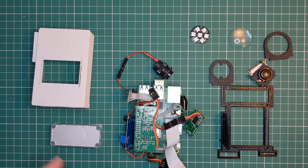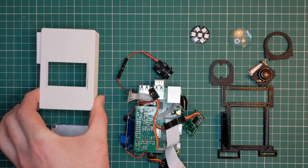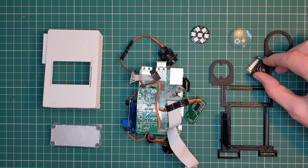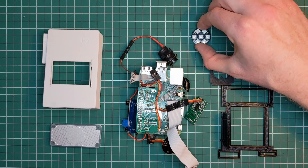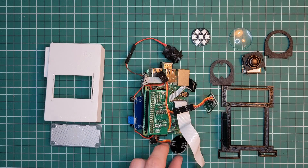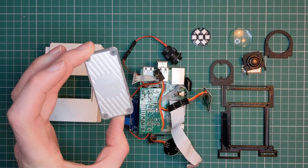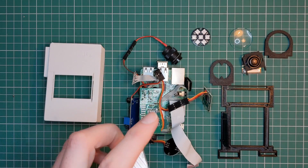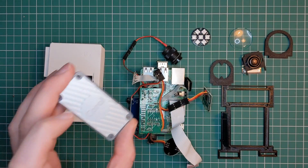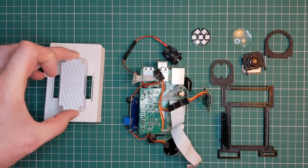What I've tried to do is pull apart the original design for the head and rebuild it in a way that means if I need to swap parts out I can do that without too much effort. For those who aren't familiar with the project, it is a small companion robot that runs with a Raspberry Pi and an Arduino connected via serial, and also has machine learning and artificial intelligence running on Python. It has a single eye which is the Raspberry Pi camera, an LED output on the other eye, a motion sensor, power management, and the ability to run various AI algorithms on the Raspberry Pi and also on the Coral USB accelerator — a fairly new addition that didn't fit in the original head and was bolted on top.